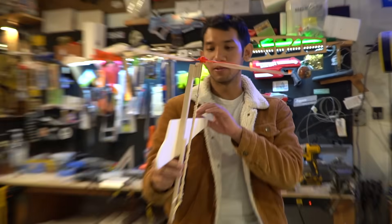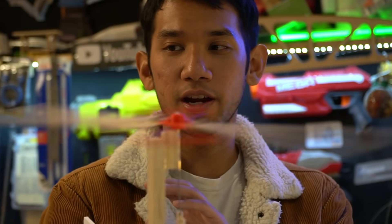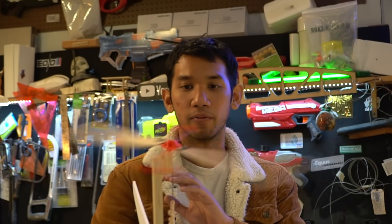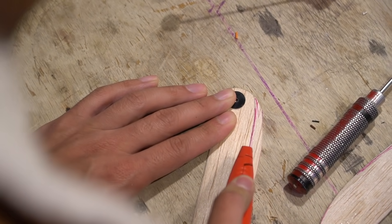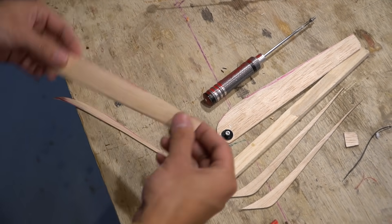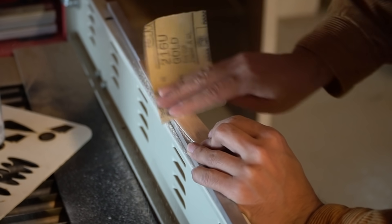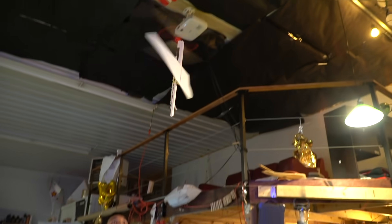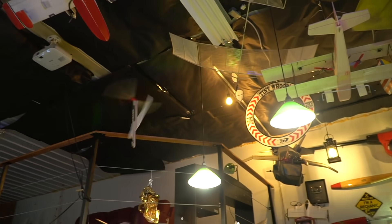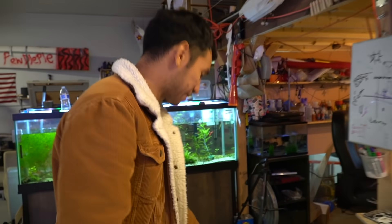There is a lot of torque here — the tail rotor is going to have to compensate a lot. I really should shrink the blades down some more and reduce the overall torque on the stick. I'm going to sand the airfoils back on these blades because right now they're really chunky on the back. Highest flight time yet — and the stick broke.